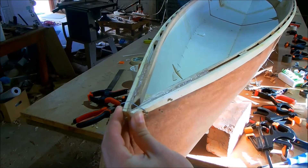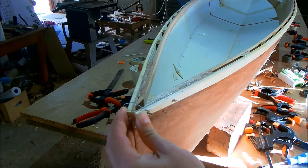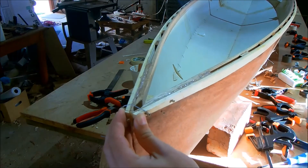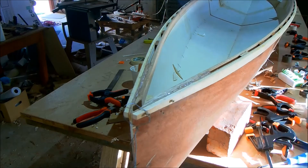Now that I try and flex the boat, the entire hull structure just turns as a unit and there's very little play between these two gunnels at the end. The wider the gunnel, the more equivalent it is to a full deck, and the stiffer it will be.